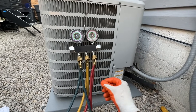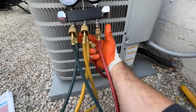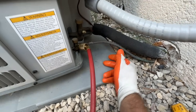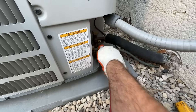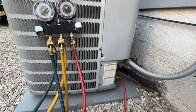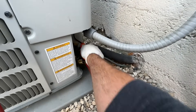Make sure that you're using gloves when you hook this up — even if you make a mistake, this acts as an extra layer of protection. So we're going to take our high side hose and make sure the bottom ones are all tight. The high side is going to attach to this small three-eighths line right here — that's considered the high side or the liquid line. You want to tighten this all the way down, then back it off just a hair, and that will save the life of these low-loss fittings. We notice we have pressure now. We're going to do the same thing on the low side — crank it all the way down, then back it off.